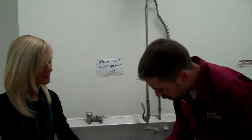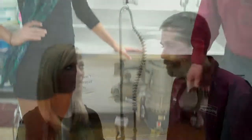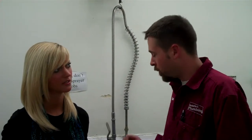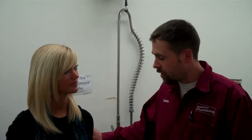So where are you going to be installing the drain strainer? Right underneath here, right next to the garbage disposal. We're not actually replacing the garbage disposal. The garbage disposal is working fine. What we're after is catching the solids after it goes through — we're going to use the drain strainer to catch those solids at the solid separator before it goes to the drain lines.